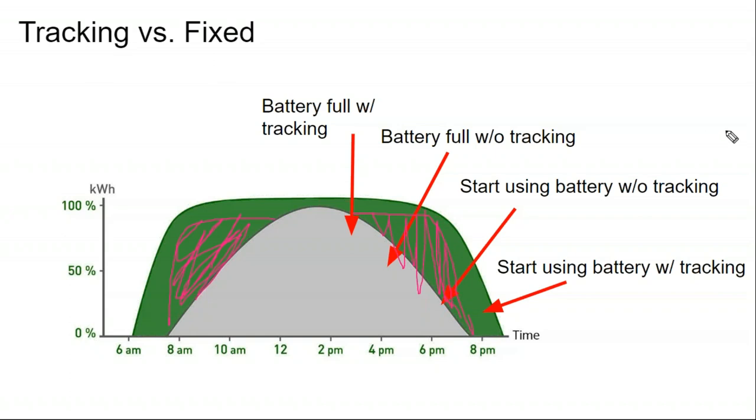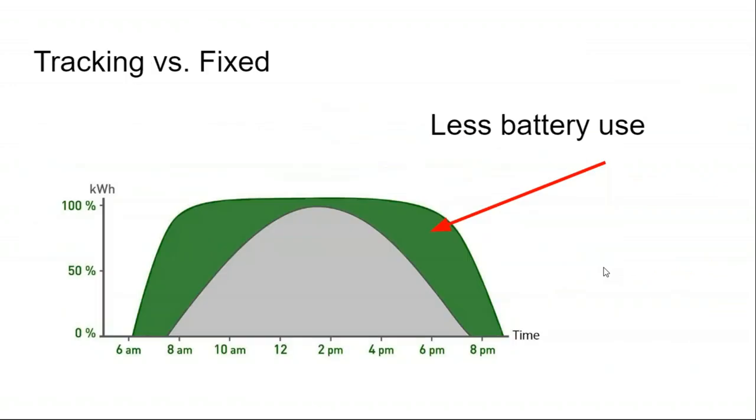Solar panels are already, in the context of off-grid systems, relatively cheap. So I don't think customers are missing out by not doing residential tracking. The only caveat being, when you live off-grid, it's not so much the hour by hour energy that you'll miss without tracking. It's the seasonal difference between summer and winter. So perhaps modifying the racking to be seasonally adjustable is something worth considering.